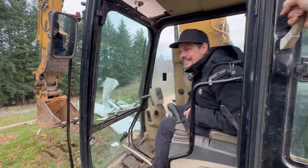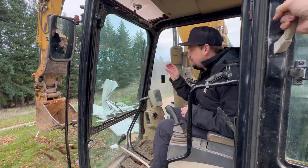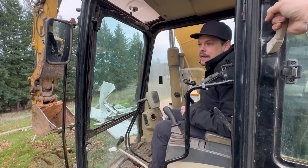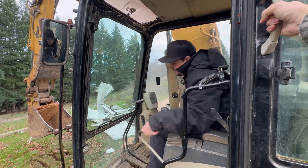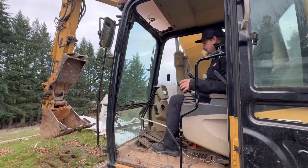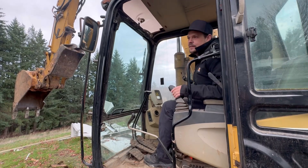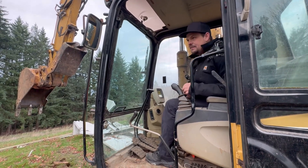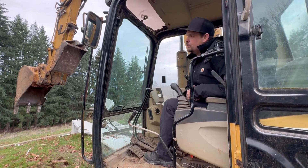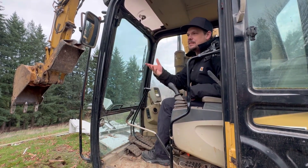I tested it, I made sure it was locked. We never move from the position until it's tested that it's locked. There is another way to test that it's locked - you don't have to hit the ground, because you can't always hit the ground. Obviously you cannot do that if the bucket cannot drop there. It's very important wherever we lay the bucket, it's a place that you can always test the bucket.